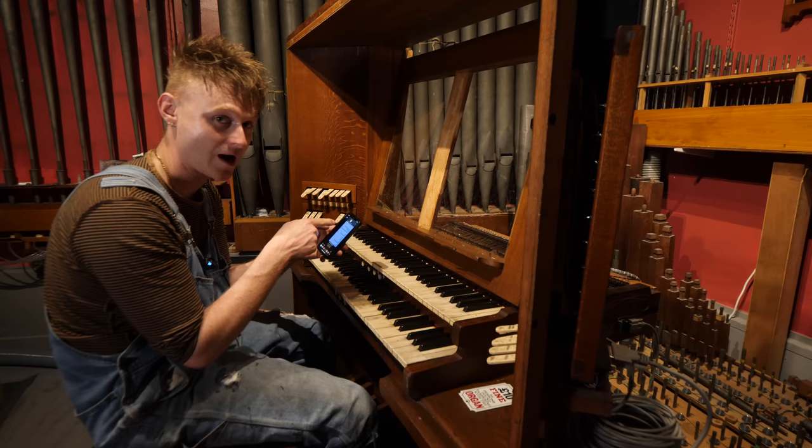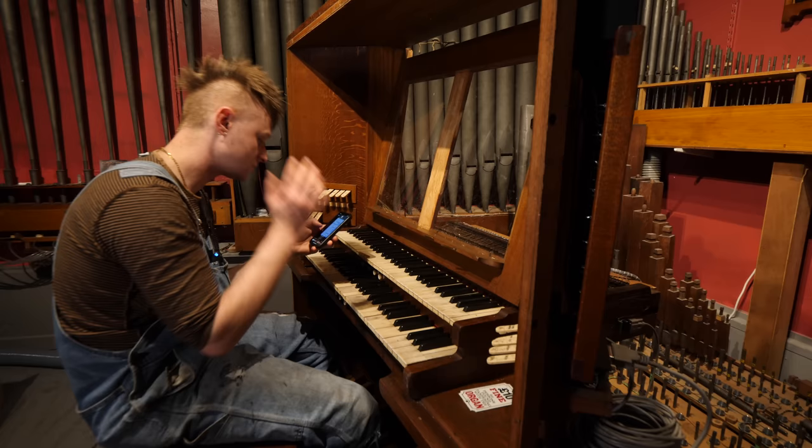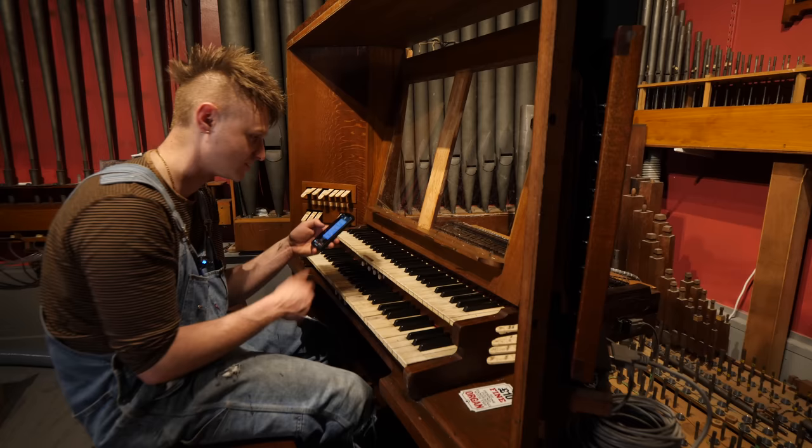Chris mentions that he reads the input states, maps it to logic to calculate every output note that should be on or off on every pipe. And also because of the limited serial buffer on the Arduino Nano, we must read and clear the input buffers as much as possible to not miss any messages, which ended up making it work very well.